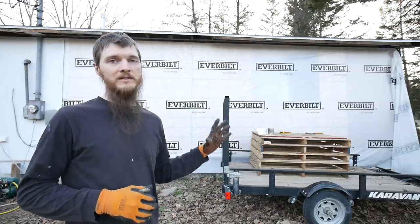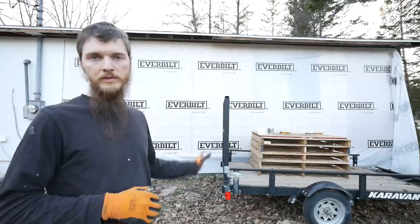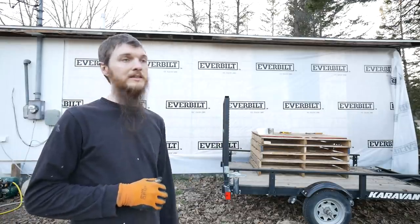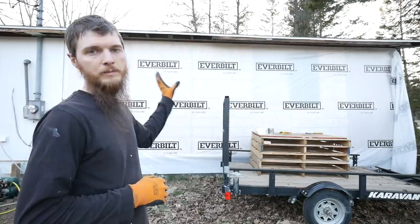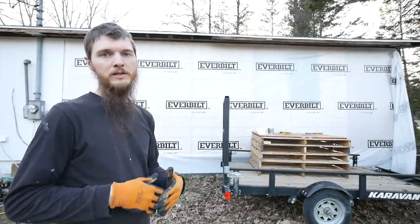We're slowly getting there on this project. Finally, all the sheathing is done. The house wrap is up. That's a good feeling. All we're worried about tonight is getting Belle's bedroom window in. The bathroom window, we just left the plywood up, the OSB.